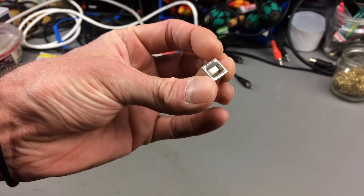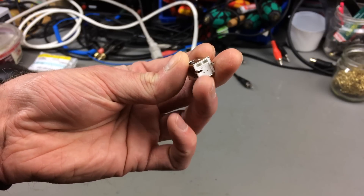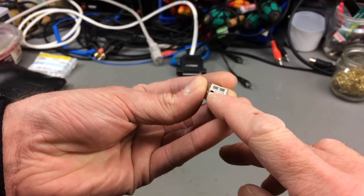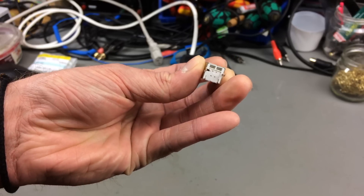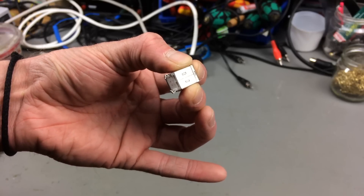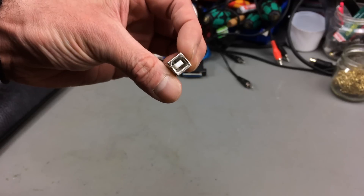Here's the broken USB jack. It's a standard A-type USB jack with four little pins on the backside. It's meant to stand on a PCB, but in this case the PCB was sandwiched between the pins, and the pins were soldered from both sides. They just broke off. So it made contact if you held it at the right angle, and you could see the microphone was working. But when I opened it, I saw the pins were completely broken off.